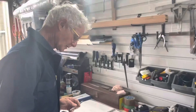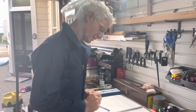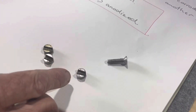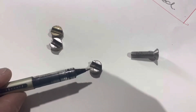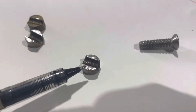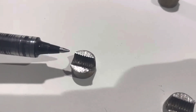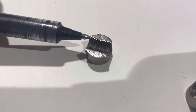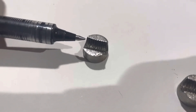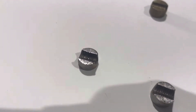On a separate but related subject to fastenings — come in very close here — these are what I call cylindrical pocket nuts, which hold our masts into the tuttle box. I've hacksawed this one in half to show you. This is a silicon bronze one I made, and you can see that through sheer pressure and force the thread in this cylindrical pocket nut has really been compromised — it's started to deteriorate and corrode away.